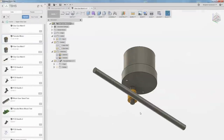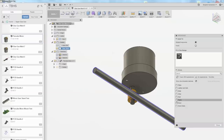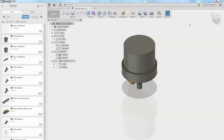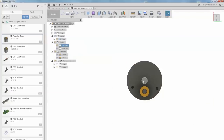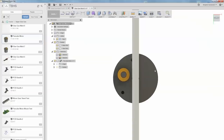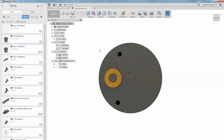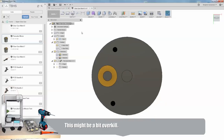I made a center point glue stick, represented by this long tube thing - I'll make it opaque matte white. I also created another object which is just a center reference point, and I used that as a joint with the motor. So if you look at it from the end view, the motor is now centered on that point. If we click on the motor, it'll actually revolve around it as well, like a planet. Now I can rotate the motor assembly with the gear and bring the gear tight up against the glue stick.